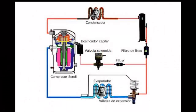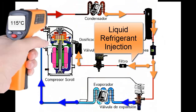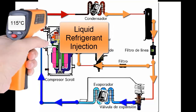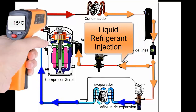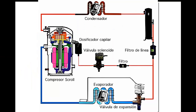There are scroll compressors that must be equipped with liquid injection using a DTC valve. There are models of scroll compressors for vapor injection only, and liquid injection alone is not possible. There are models of scroll compressors that can be used for both liquid and vapor injection (EVI). There are also models with wet vapor injection, meaning a combination of vapor and liquid injection simultaneously.